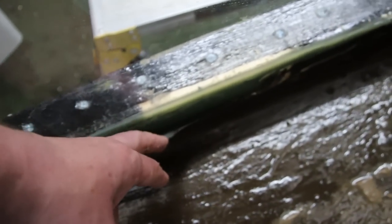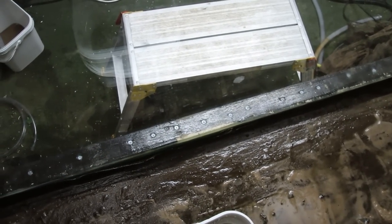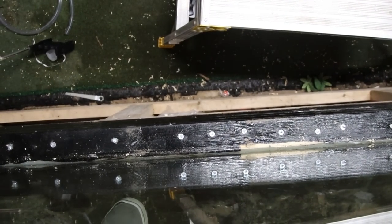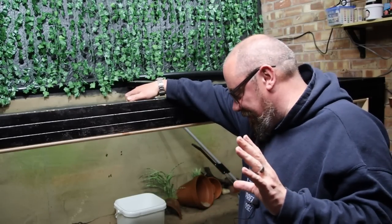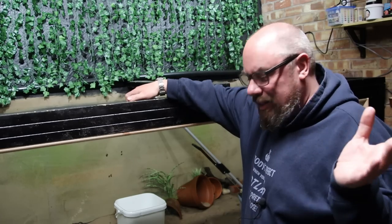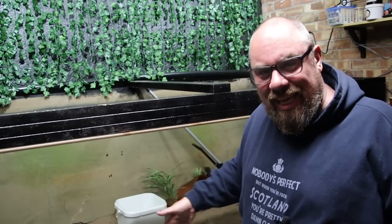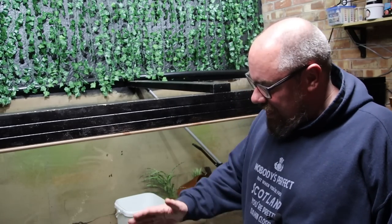The sides are both fine, but basically what's getting in is the water — it's getting into there, going under, and finding its way out. So if we assume that all these extra screws I've put in are now going to hold that in place, it should just be a case of filling this with a big bead of silicone, blocking that off, and we should be good to go. Second thoughts — I need to let this dry out a bit. I think I'm just going to do the work now rather than test fill after siliconing it and have it fail inevitably. So I'm going to cut out the bit that's delaminated and re-fibreglass behind the glass — where the glass meets the tank — put in another fibreglass layer there and cover it up with the liquid rubber.